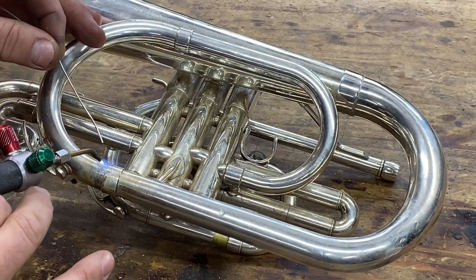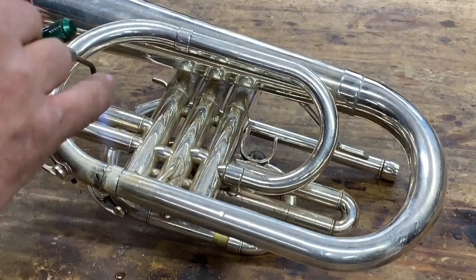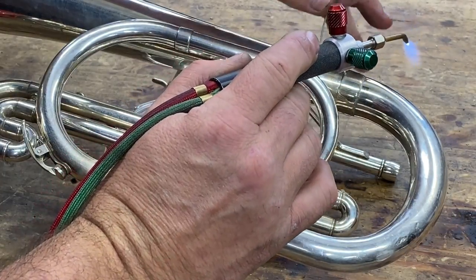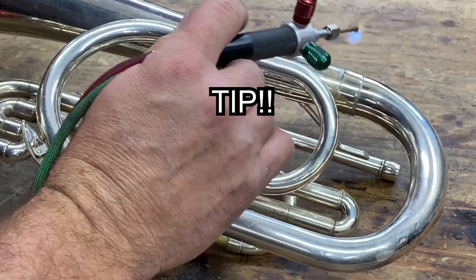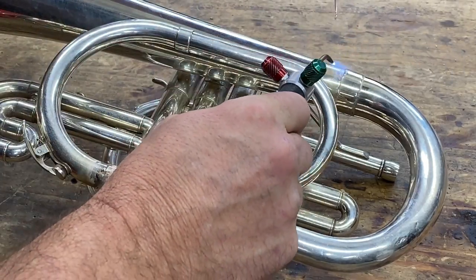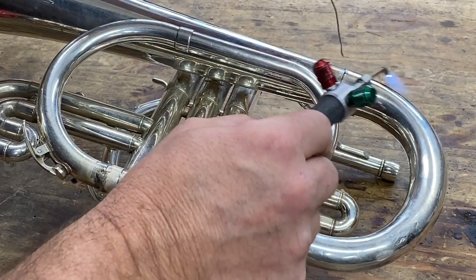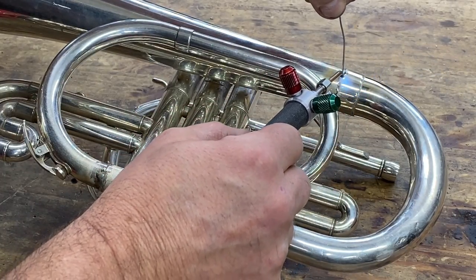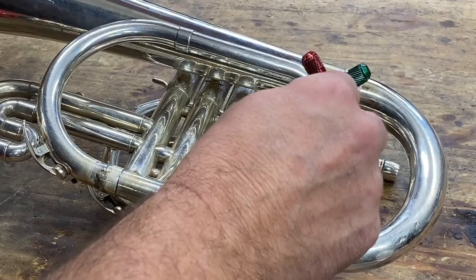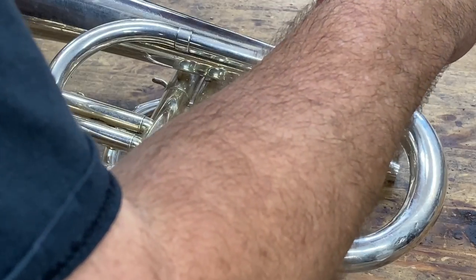So remember, same as the other kind of soldering, and that's it. When this happens, when your solder goes to the one section more than the other section, your solder from there on will have a tendency to want to jump up there. Move your location. So start your joint somewhere else. And sometimes that will pull this solder back where you want it to go.